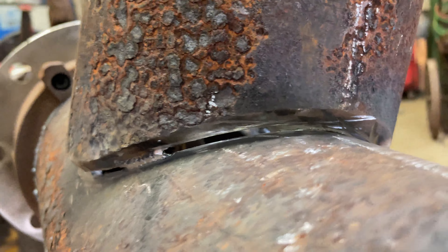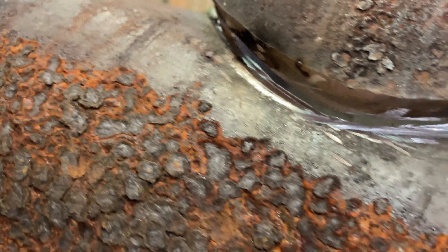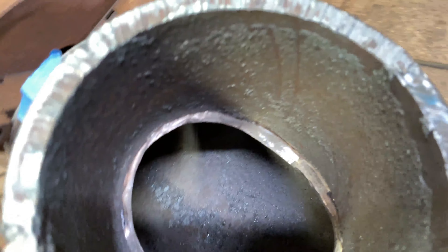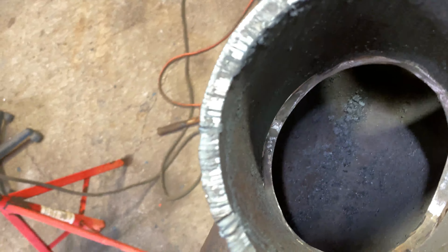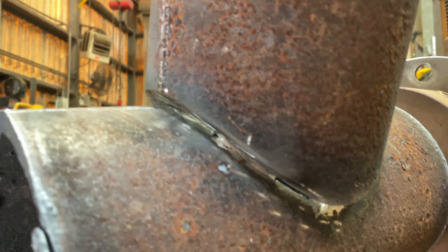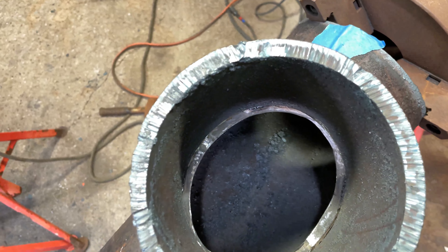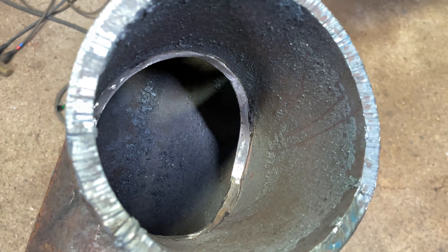After a good little cleanup, it's actually ready to put a bead in there. It's not the most perfect fit, but if you try to get the most perfect thing out there it's going to take you all day, and you really don't want to be stuck in a weld lab all day. If you can go ahead and step it in there, why not? Remember, all you got to do is burn the walls — no blow-throughs, no heavy beads, no porosity in there. Just a little clean bead in there, guys. It's a saddle, that's it. That's enough for today though — I've got to go get the right rods and make a different video on the welding.